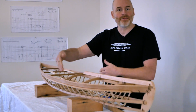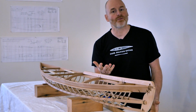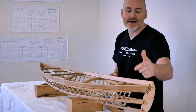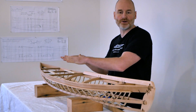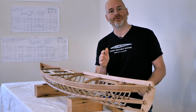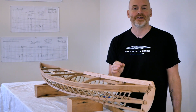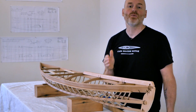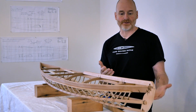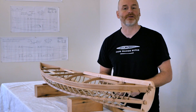While the width, length, depth, and dimensions of scantlings all change for each different size F1, one thing that remains universal is the layout of the deck beams and ribs along the gunnels. Having a universal layout makes the plans a lot easier to use. The one caveat is that I do change where that layout is referenced from for different size paddlers — and this is a really important point.